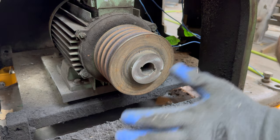At this point, I wasn't quite sure if I wanted to paint the inside of the motor cabinet. I would have gone through 1/2 gallon of acetone and I don't know how many paper towels trying to clean it. Eventually, I decided to simply cover up the motor with a plastic bag, get out the pressure washer, the spray bottle of acetone, and just chip away at it until any of the water running away from it wasn't black.